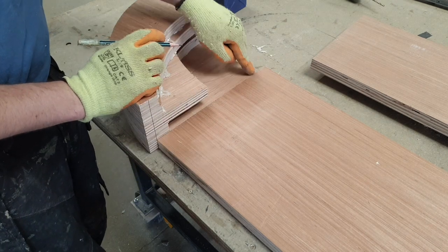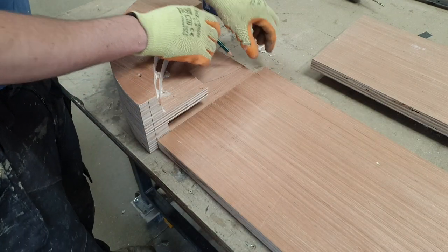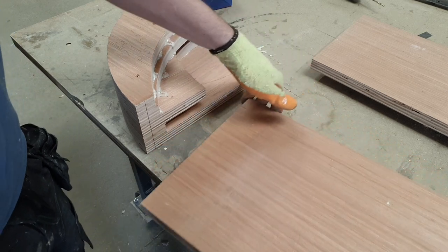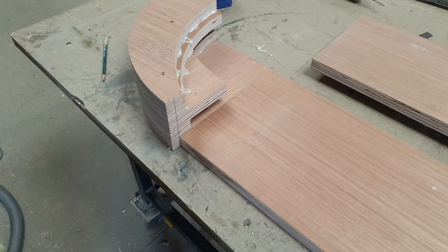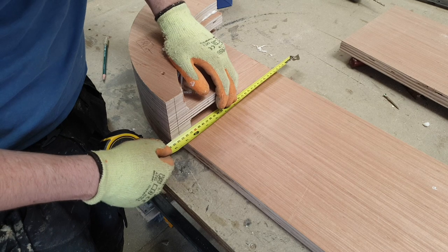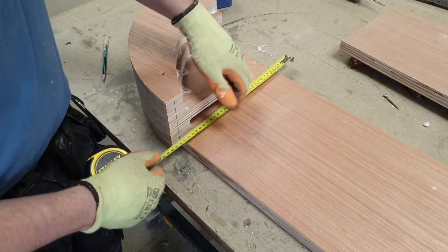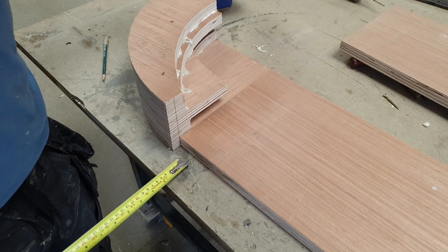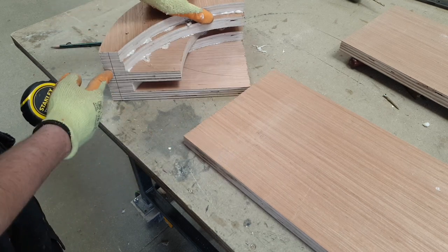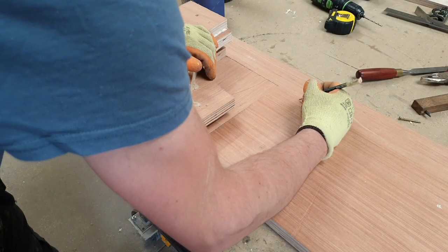So I'm going to trim this off flush with the 90 degree at the back, a strip in here to accept the end of the engineered flooring, keep it square in this direction. So the step needs to cover a 350 mm go. So we've got about a 2.5 mm veneer. So that leaves 60 mm at the back, so I need a 60 mm board running down this piece with a square cut on the end, and we'll stop that in line with the same position on this side as we did on this side. Now I can just join and domino them together.